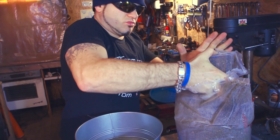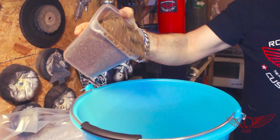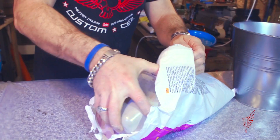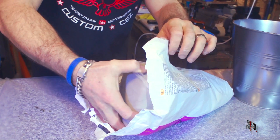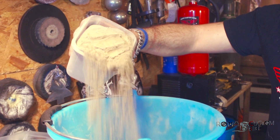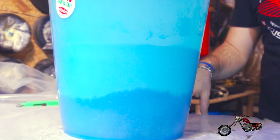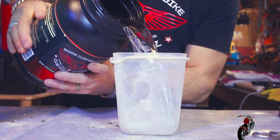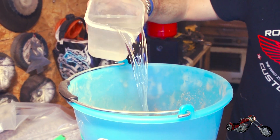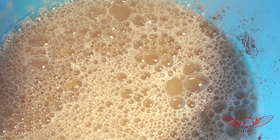Now since we've talked about the recipe, let's start with the ingredients. We're going to put in 3 parts of construction sand, followed by 3 parts of refractory mortar. We'll drop it in the bucket slowly because it's pretty volatile. You can see through the bucket the two equal amounts of material. And finally we can add 2 parts of water. Very bubbly — just the way we like it.